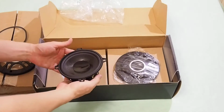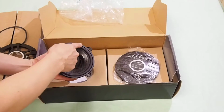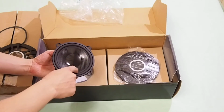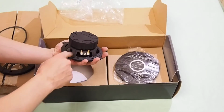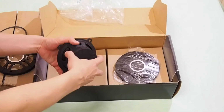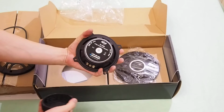The woofer is very hard. Its waist is a little bit bigger than ordinary. Here we have a rubber mounting place and also a polypropylene injected diffuser with cap. Here we have gold coated connections and special coating on our steel frame. Also we have the rubber component that we have taken off now.